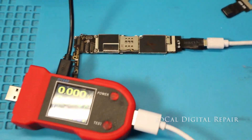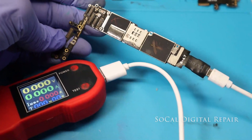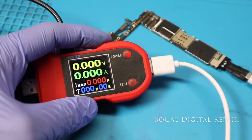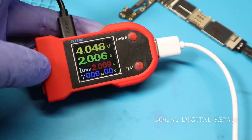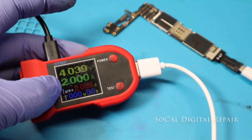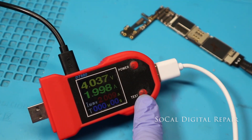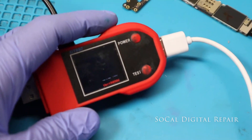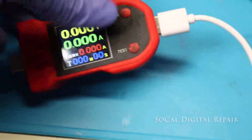I have an iPhone 6 here — this is an actual problematic board sent to me by a shop. It has no power. Now let's see what happens when I click the power button. As you can see, I only clicked power and we're already getting a 2 amp draw from the device. I haven't pushed test because I didn't need to power it on — you can already see it's drawing power. It's actually drawing so much power it resets the device.